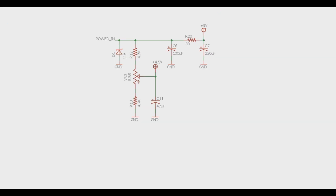So we're going to start here with the power supply of the pedal. First off we have a Zener diode to protect the circuit from getting out of control with voltage — you don't want to pop your BBD device that cost you a pretty penny. After that we have a voltage divider, and we also use a trimmer pot in the center to fine-tune that voltage division so that we get very close to 4.5 volts for biasing not just the op amps, but the signal going into the Bucket Brigade device. Bucket brigades are very picky, so you have to be very spot on with your biases, or bad stuff happens.